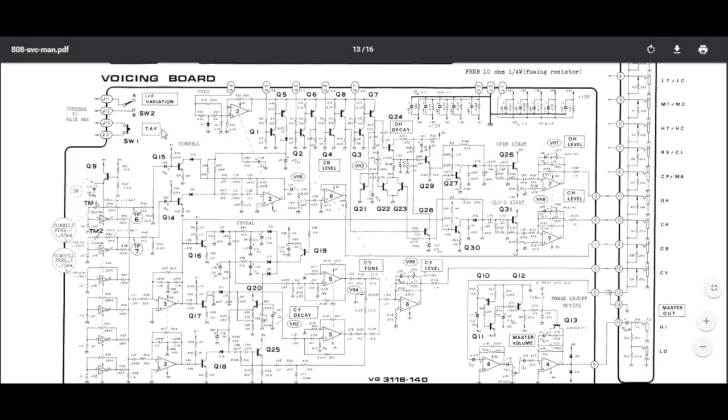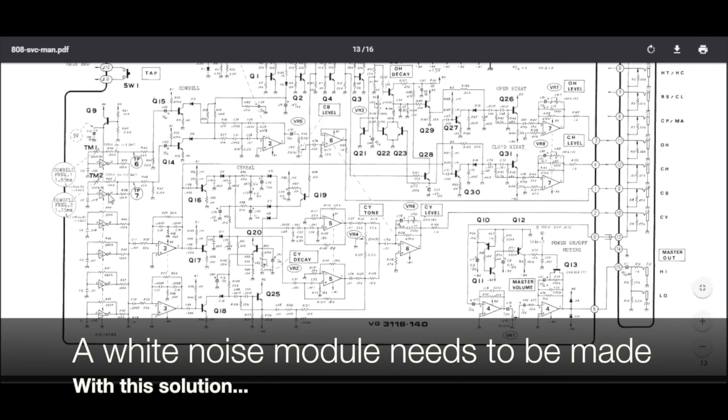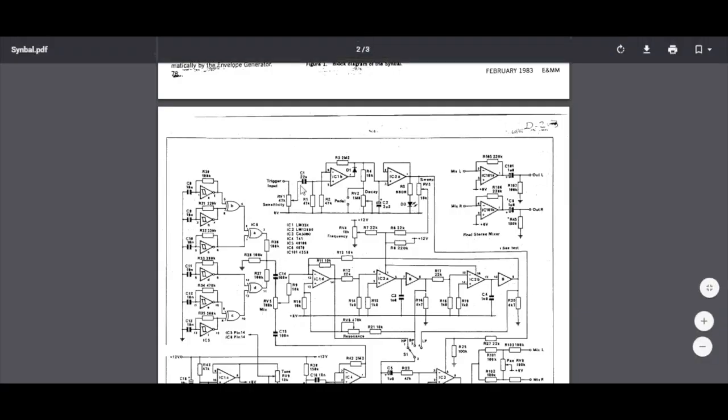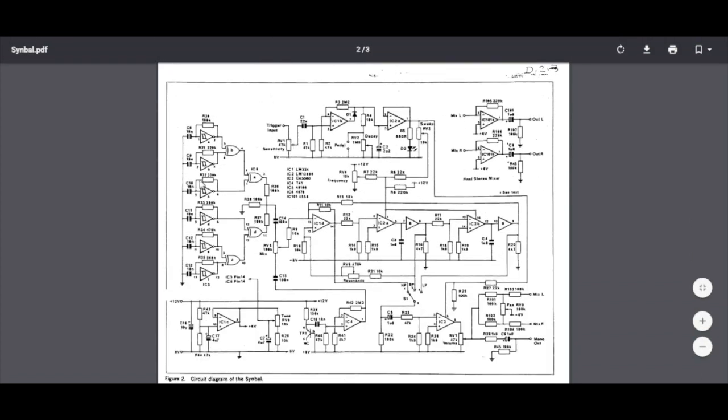He talks about the 808, which doesn't use the XOR. It just uses 6 differently tuned oscillators with a 4106 to create a kind of white noise. It's spread, so it sounds like white noise, and they use that for a lot of things; the cowbell is among them, and the cymbal is another. There is also this cymbal module, which he links to in the series, I think. Here we also have the 6 oscillators, the 4106, and this is that exact circuit, XORing 2 together with a third, and just mixing those 2 signals.